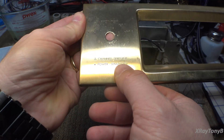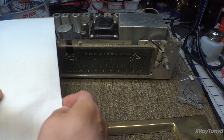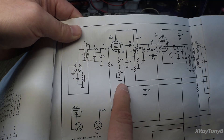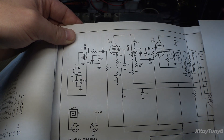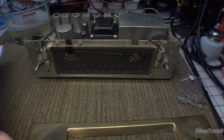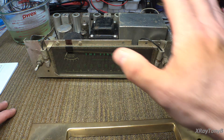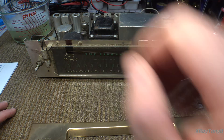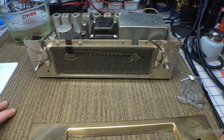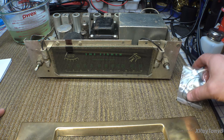If you look, it's a sensitivity knob. Looking at the schematic, at the very input of the RF amplifier, it is a sensitivity knob. So this does not have a preamp per se. This is a line-level output, unattenuated, and you would feed this into a normal preamp and amplifier — like an integrated amplifier — and the volume would be on your amplifier. This is a very unique design, as you usually find out with this older Fisher equipment.